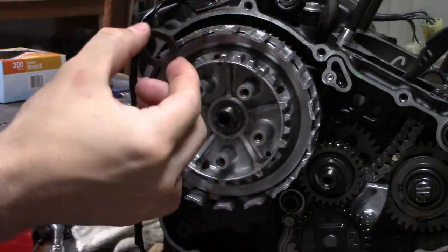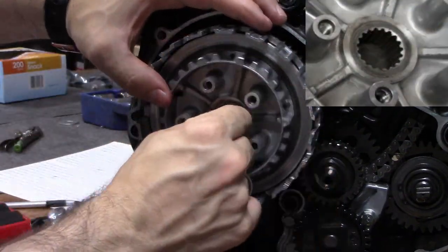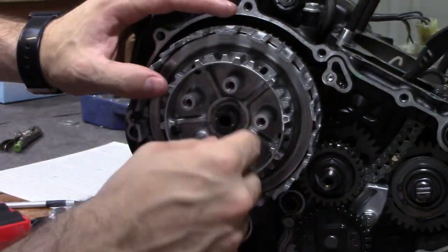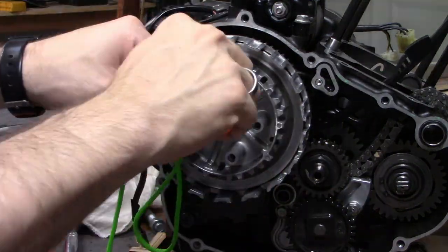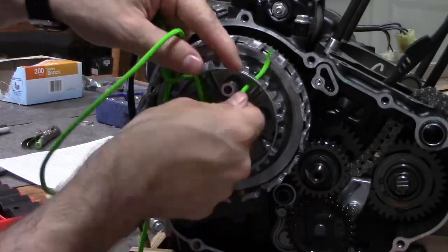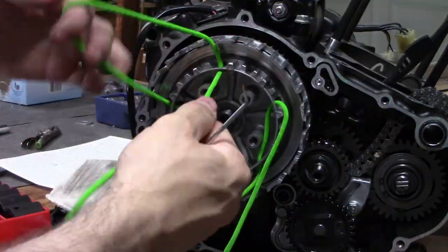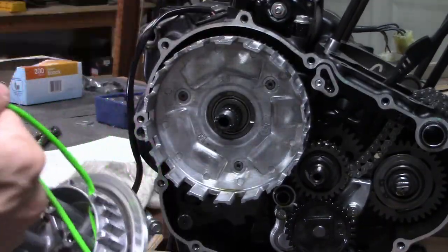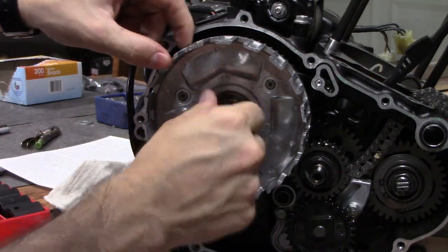With the nut off, we should be able to just pull off the inner carrier. The inner carrier has a close-tolerance spline fit to the shaft. I couldn't really get a good grip on the carrier, so I threaded some paracord through it again, which allowed me to get a good grip and also helped me pull very parallel to the axis of the shaft. This worked great for pulling, and also worked as a convenient method for catching the suddenly-free component. This outer piece sits on needle bearings and came out really easy.